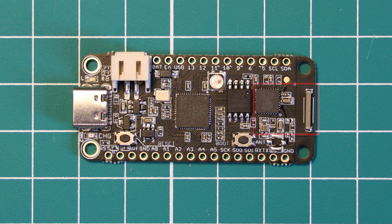We can't miss the 2.4GHz B, G, and N Wi-Fi connectivity of this board. This is provided by an ESP8285 coprocessor, which is a single-core Xtensa L106 32-bit RISC processor clocked at 160MHz and includes 1MB of internal flash storage. This chip runs an AT command interpreter, which allows the RP2040 to utilise the Wi-Fi functionality by sending simple commands over a UART connection. The AT command interpreter handles these commands, executes them, and sends AT messages back to the RP2040 when data is received. There are two antenna options: the version I have has an onboard chip antenna, but the board is also available with a UFL connector. I've had no problems with connectivity and signal strength using the onboard chip antenna during normal usage.